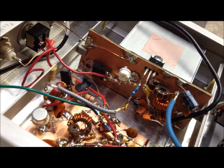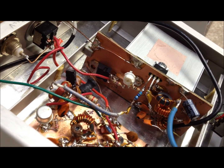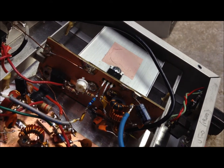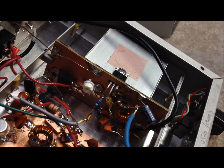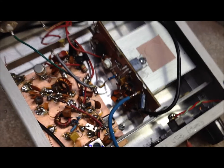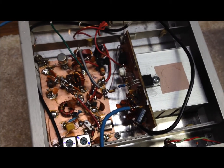There's a little variable pot on there that you can see, and to the left there's a little voltage regulator as well. With that regulator we provide 5 volts through a little circuit so that we can adjust with that variable pot the bias to the output amplifier, the IRF510, which is an FET device. It's critical to get that bias about right — it's right around 3 volts. But once that's set, it stays solid, and this setup will give us a good 3 to 4 watts of output, maybe 5 watts depending on the antenna and tuner.